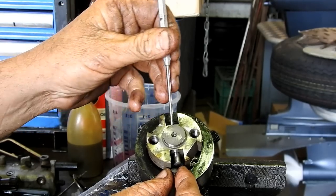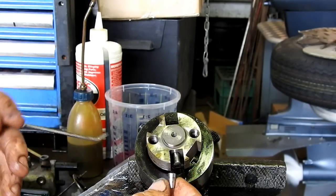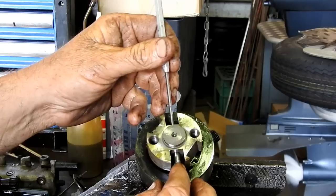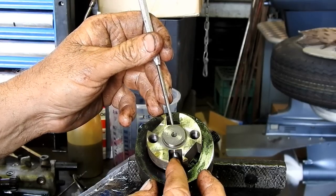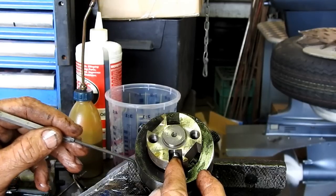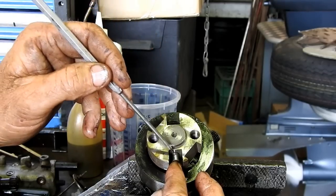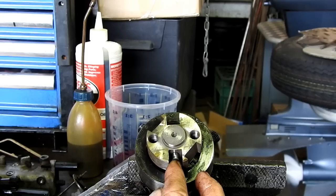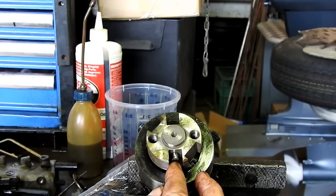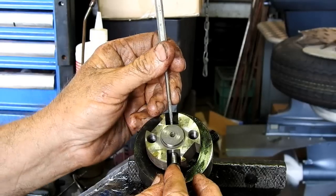And if you've had water in your system, because all this is just floating through on its own, it's certainly possible that these little rollers get stuck. And so they stick out. Now, how it works is your fuel transfer pump at the end here, it puts a certain pressure, a few pound in, and that pops these rollers or these plungers out. Then they push out on the back of the, you'll see a little mark there, they push out on the rollers, and once they push out the rollers can only go so far.